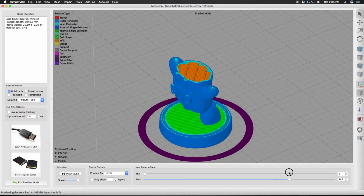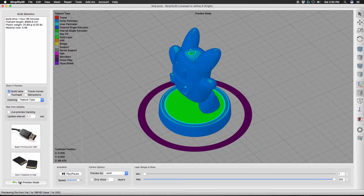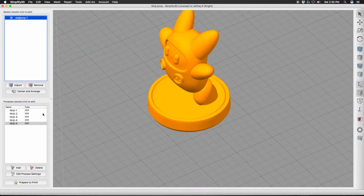And then through the top here we could speed it up, because there wasn't a whole lot I had to worry about with that section. Then at the top here for his little horns, or the rest of his little body parts, I used a much slower process to go through this area, and I turned off the infill because I knew it didn't really need that. So if I exit out of here and we take all these processes out, we'll delete these.